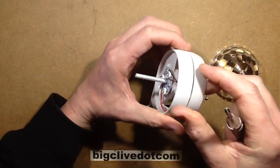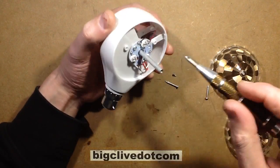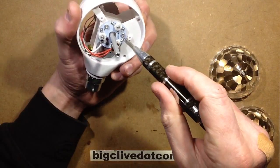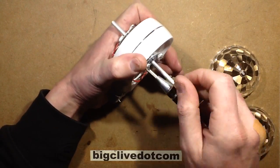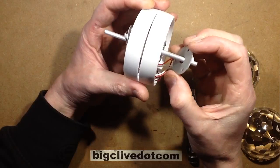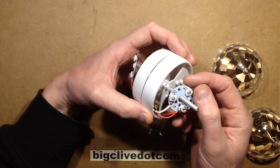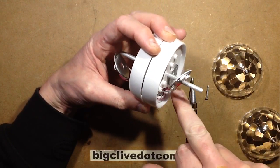I've taken the screws out but it's not going to part — there are other screws holding this circuit board on. It's not going to come apart because it's crimped together at the base. But let's take all the screws out. What it yields is these two LED circuit boards designed to run on a supply. Typically the LEDs in these will be in series, so the combined voltage — green and blue, and the red — will be about 8 volts, so you'd have to use current limiting, which is what's down in here.